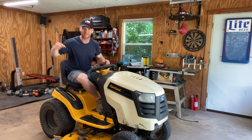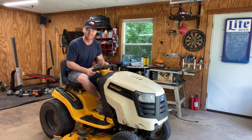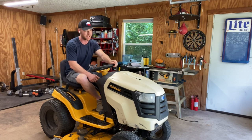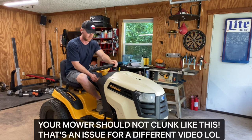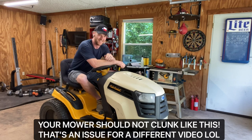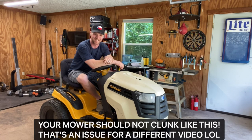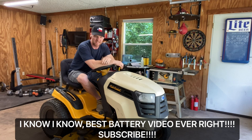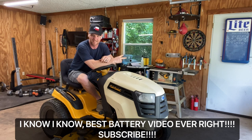We got our battery hooked up and charged up, and we've got our terminals clean. Let's see if she'll start. Now this Cub Cadet — I've never seen it actually start, so if it cranked up I might flip out. That doesn't sound good. She's not starting, but she sure is cranking good. So I hope that helped. Remember: clean the battery terminals. If you don't have a battery charger, try cleaning the terminals first on the battery, then maybe the terminal on the starter, then go charge the battery. If it's bad, just get a new battery — they're like 40 bucks. I like going to AutoZone and getting the Duralast batteries — they're really good. Please subscribe, and with that I'm out. Let's move on.